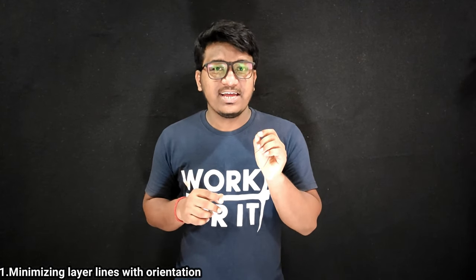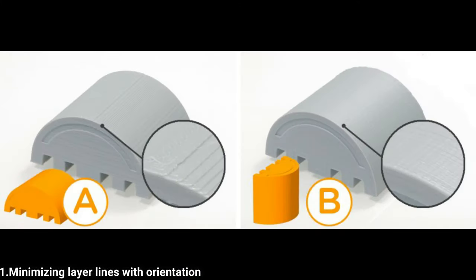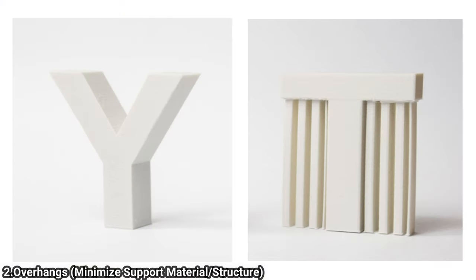This stepping at each new layer height is only visible in the z-axis. So while the 3D printer cannot replicate a perfectly smooth curve or diagonal line in the z-axis, it can print this same curve or line with near perfection in the x and y-axis. Horizontal top or vertical surfaces of a print will typically print with better quality than the print underside, where overhangs require support or bridging.